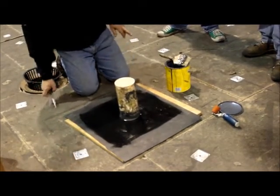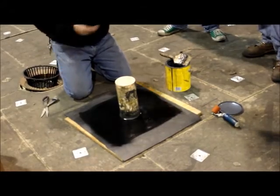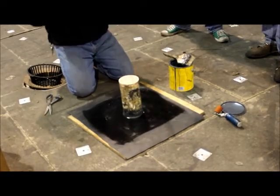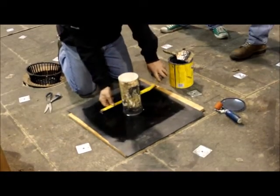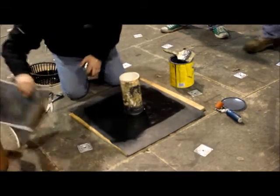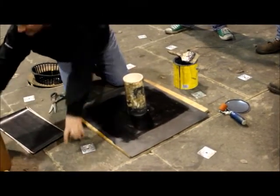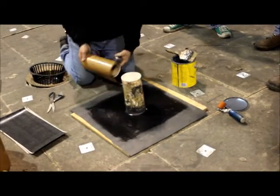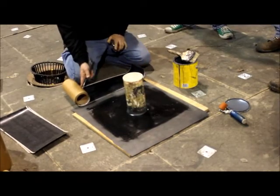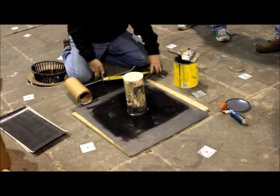How do you cut the piece? You have to be at least three inches past each side — I go full. We're going to add a 13-inch piece. This is nine inch, so we're going to end up having to put two pieces on it. We can't just put the wall. We're going to cut two 13-inch pieces.